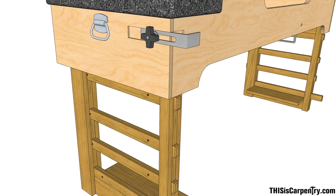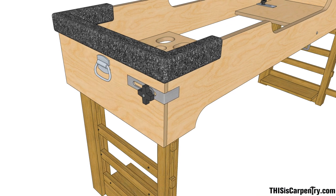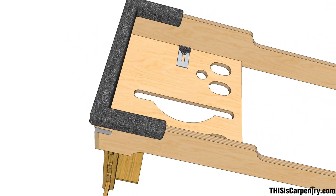You can make the door hook pretty easily from a piece of 1/8 inch or 3/16 inch aluminum or steel. Bend one end for the hook and cut a long notch to slide through a threaded knob. Be sure to mortise the hook into the end of the bench so it won't wiggle around.